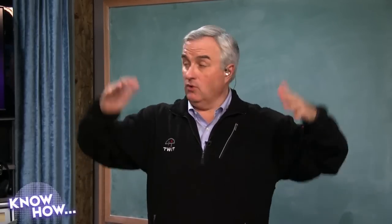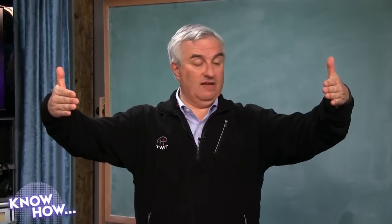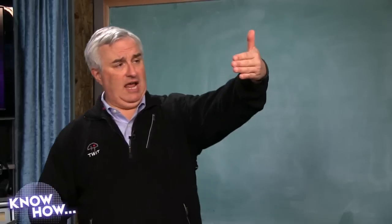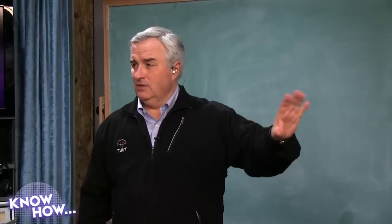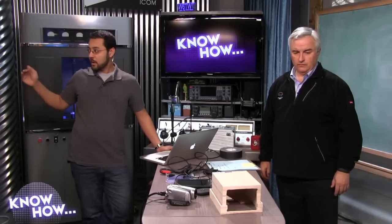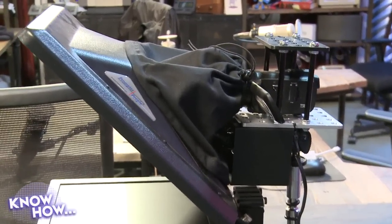Well, below it, which you don't see, is text being reflected up into it, and he can see, if he looks left and right, the text of his speech. The show host can see, stay classy, San Diego, right in there in front of the screen. Yeah, if you look behind the glass, you see that there's a hood back there, because if any light gets to that lens while it's trying to look through, you're going to see the text there. You don't want that, so you want to make sure it's all covered up.